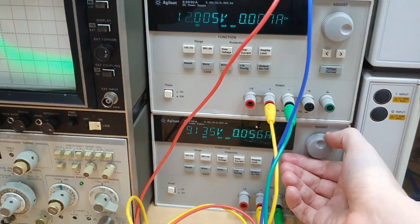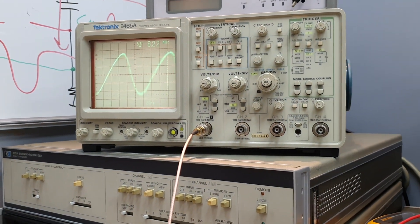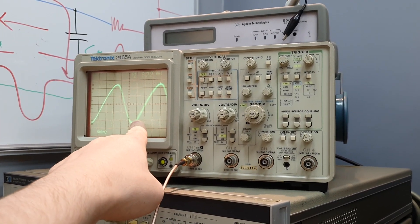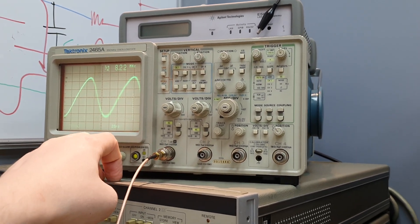If I change the voltage here to change the frequency, you can see that the signal is very strong. It will excite directly the flip-flop of the phase comparator of the PLL of this system.